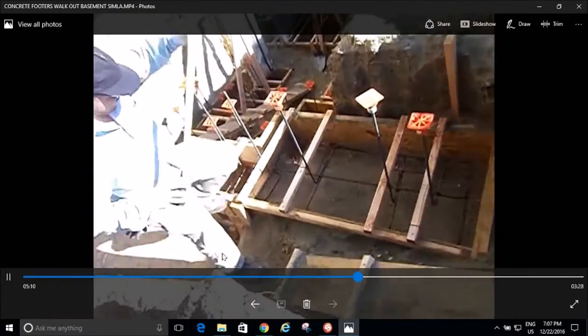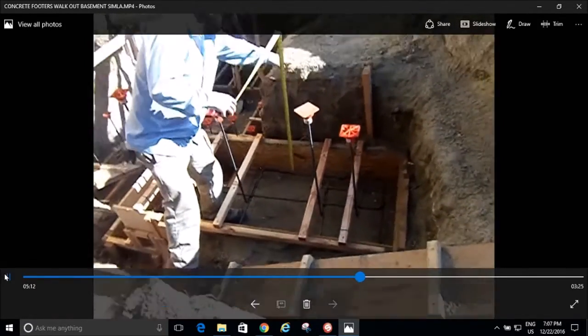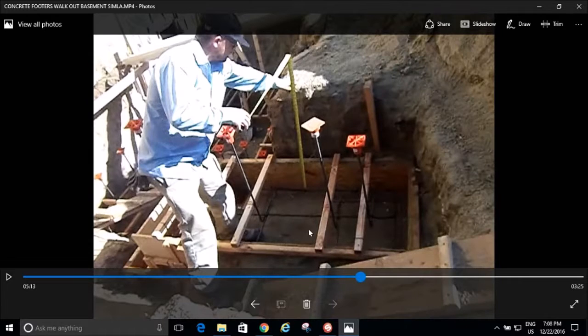And that footer right there, this little wall right here, that's plenty wide too, and later I get an 8-foot wall on top of that. So I'm way down farther than I need to be, but it's going to be in a garage, and I don't want somebody to come and crash the vehicle into it and crumble the wall and go falling down into the hole. So I made these footers as strong as I thought I needed to.